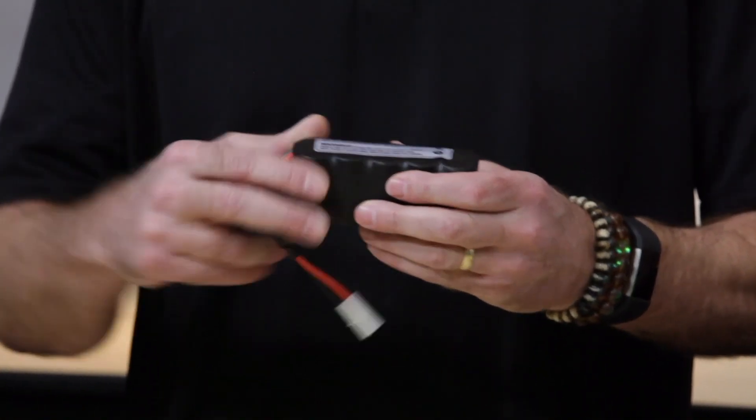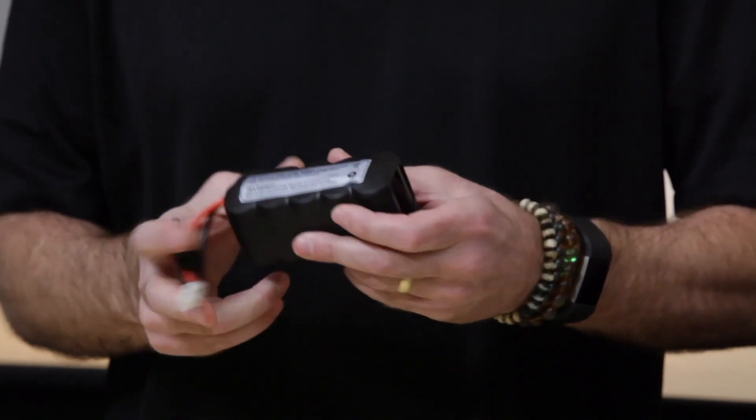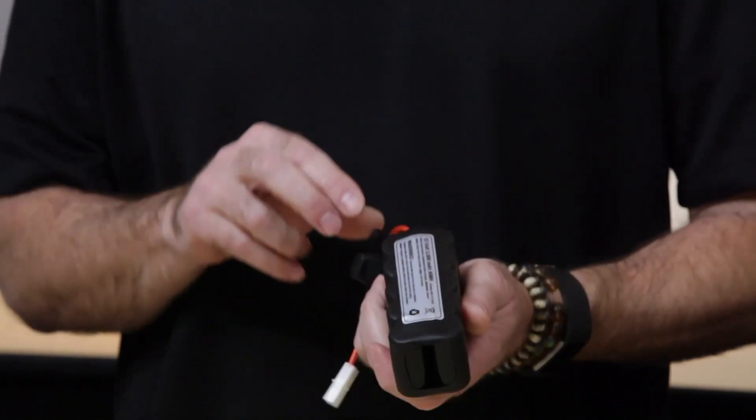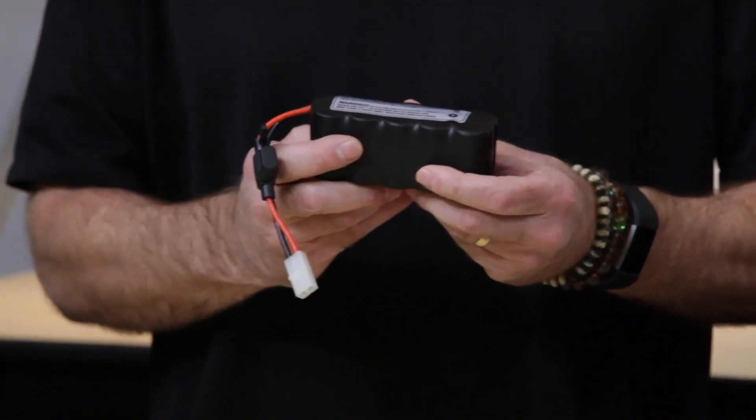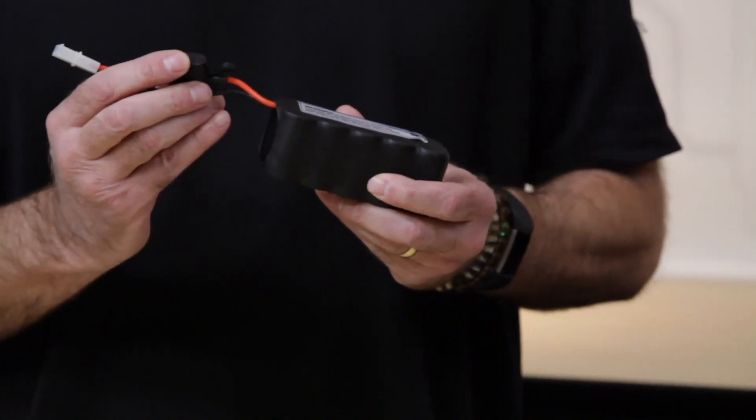We brought some of the batteries out. Tell the folks a little bit more about that battery. So this is the battery that we use on our Tetrix Max sets — our high school solution. This is the 12 volt, 3,000 milliamp hour pack, 10 cells, C size cells. One thing you'll notice that you won't find on a lot of battery packs is the inline fuse. Even though the battery pack is safe, we all know that we make wiring mistakes, and our robots have gears and all kinds of moving parts, so we want to ensure maximum safety. Our battery packs that are big and powerful like this all come with the inline fuse.